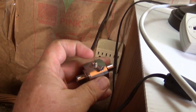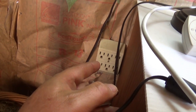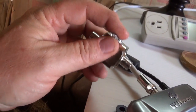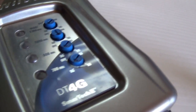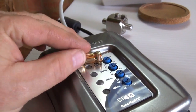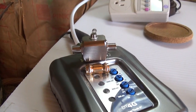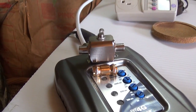I'm going to have to figure out where to run this wire. I'd prefer to put it through the box so I don't have to drill through the wall, but if I have to I will. So this is my lightning arrester — it goes right here, I take a wire from here and ground it. I need those two pieces plus some grounding wire. I can use any solid wire — bare wire or green, red, black, or white — as long as I know it's ground.